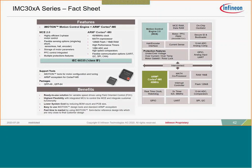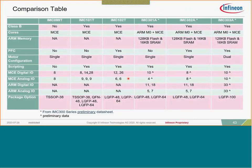The 64-pin and 48-pin versions utilize PFC control. We also have a dual-core configuration: one core is a full MCE 2.0 core and the other is a blank core to run other system processes — a fully programmable Cortex-M0 that you can run whatever you like, and theoretically you can control two motors with this solution. This is available with and without PFC control. Transitioning from left to right across the product portfolio, you see single-core devices on the left and dual-core solutions on the right, with IO count increasing as pin count increases.